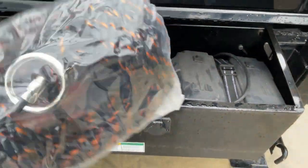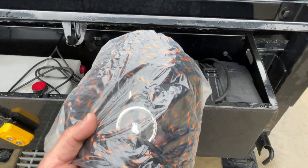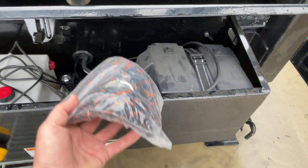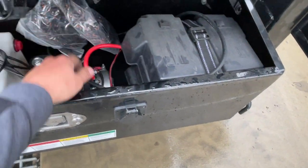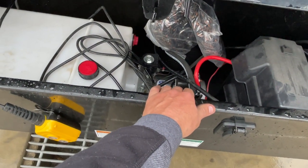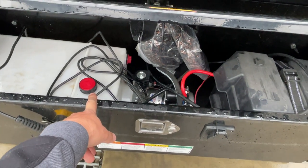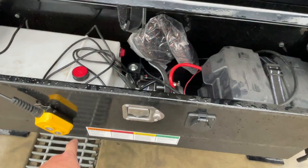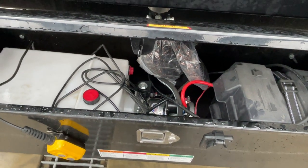There is a rope in there if you want to hook it on your tarp for deployment, especially with this setup because it's got the sail bar. This is a power-up, gravity-down hoist, as are most of your telescopic hoists, and that is why you've got the bigger reservoir.